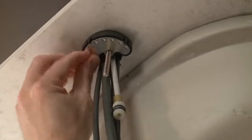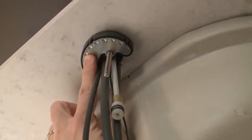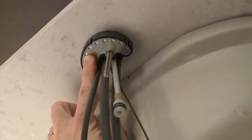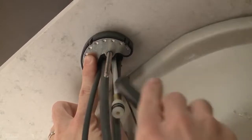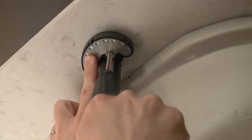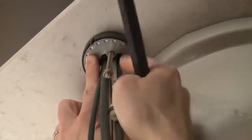Under the sink, slide the insulating bracket over the shank, making sure the metal side is facing down. Make sure the bracket is in position firmly and evenly against the sink, and that the LED wire is not crimped. Thread the nut onto the stud and hand tighten. You may find it easier to initially use the tool provided to thread the nut, then hand tighten.